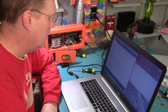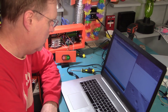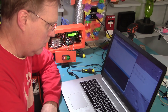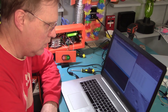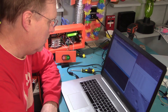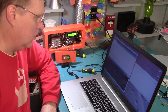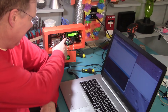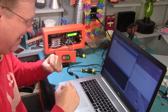The Arduino was then programmed to manage input from the microphone, the two buttons on the front — which you can see detached in front of the box right now — and the radio control device. This allows us to have the unit turn on whether it hears a sound, whether we push buttons on the face of the unit, or if we use the remote control from across the room. If the microphone hears something, it starts a job for two hours. If the buttons are pushed, it adds one hour to the runtime or starts it for an hour. Same with the radio control. And the red button stops it. It works — everything's functioning properly.